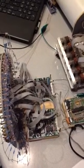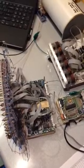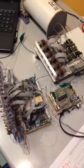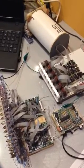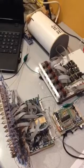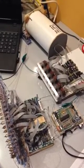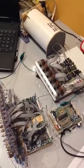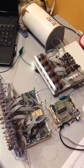This is a short video update on my Nixie clock that I'm building. I've just got them lashed up on breadboards and bits and pieces at the moment. Top of the picture you can see a temporary 160 volt supply for the neon. It'll be very much miniaturized for the final clock, but this gives me plenty of oomph for experimenting on multiple displays, and it'll just take a lot of punishment.